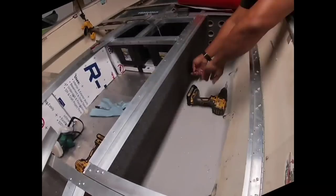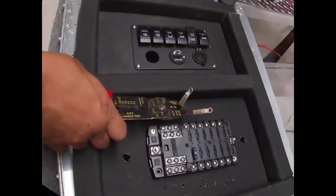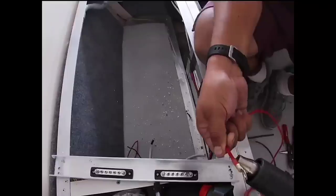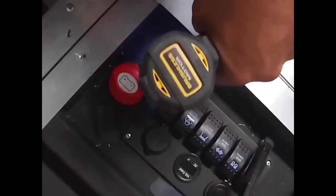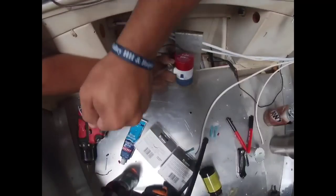So if you bootleg something and you get caught up later — you get tickets and fines, or if your boat sinks — it's on you. For the electronics we're using all marine grade wire and all marine grade products, and we're using connectors that seal off the wires completely. We're also running the wires at the highest point we possibly can so it's harder for water to overtake the wires and compromise them. We're running everything insulated. Nothing gets shortcutted here.